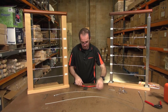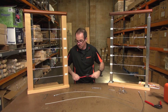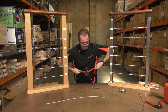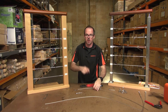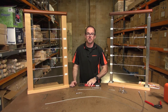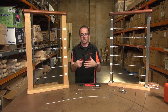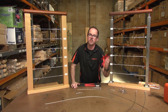Now I mentioned it's got a built-in cutter — it's a little bit hard to see here but I'll show you closer shortly. It's got a cutter here on the side, so what you can do is pop that in, open it up, pop the wire in there, bring it down, and cut — you've got your wire cut. The beauty of that is as you're reeling your wire off to do your job you cut it to the correct size, so one tool does both applications. This saves you money compared to the hydraulic swaging method where you have to buy the hydraulic swager and then also a separate cutter.